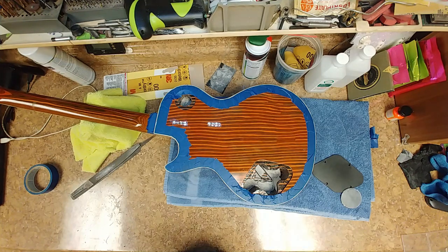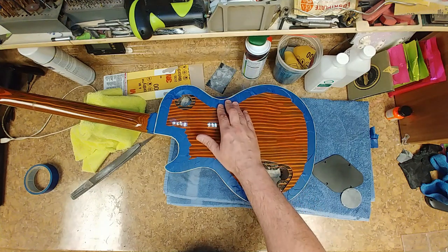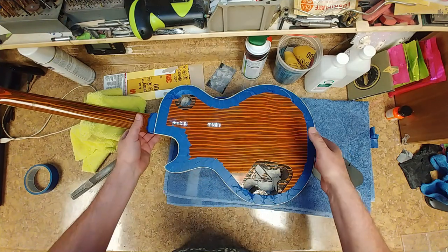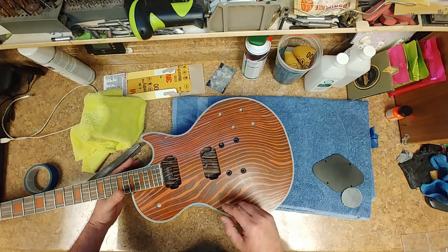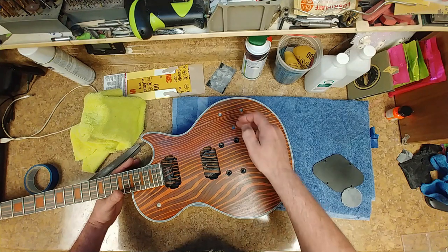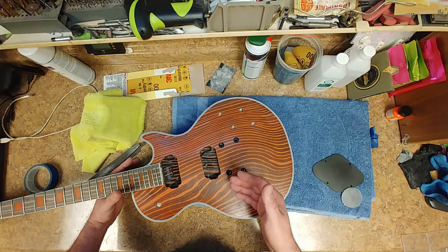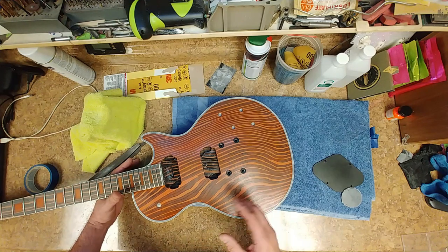I left a little bit of overlap so the overspray will kind of go over and coat around the edge. If there's a line, I can sand that off and polish it. There's still a clear coat on the back and on the edge of the binding. On the top, I sanded back the sanding sealer a little bit, making sure I didn't go through it this time, and I inserted the inserts for the bridge and the tailpiece. I've got my ground wire in there as well. I'll mask these off and spray my clear after I get the decal. I installed the inserts now because if I try to install them after the finish is cured, it could crack or chip.